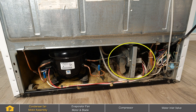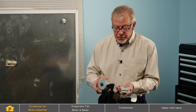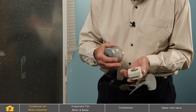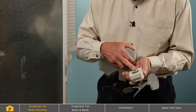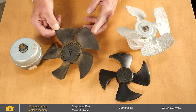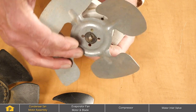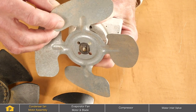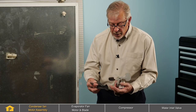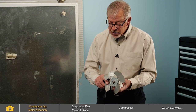and typically is behind a cardboard or metal access panel. These are a few examples of condenser fan motor assemblies. You may have a large metal type motor or a smaller enclosed plastic style. The fan blades may be either plastic or metal, and anywhere from four to six blades. What we want to look for is a damaged fan blade with part of the blade missing, or a damaged metal one where it's either bent or distorted.